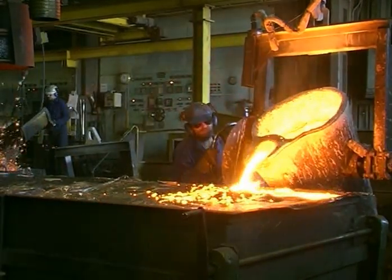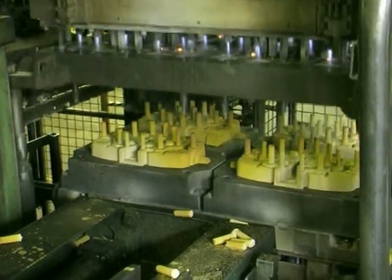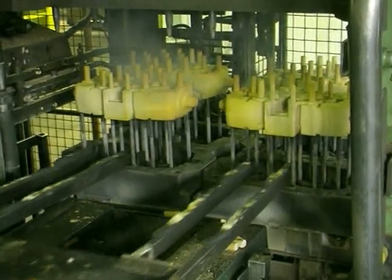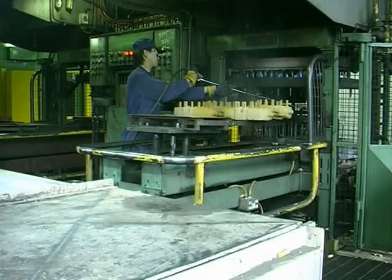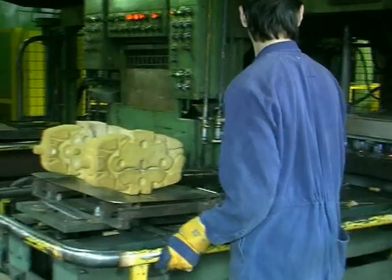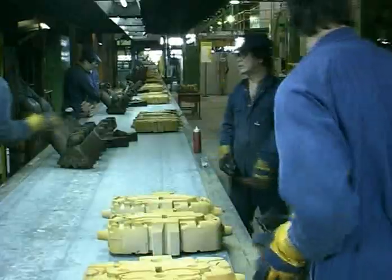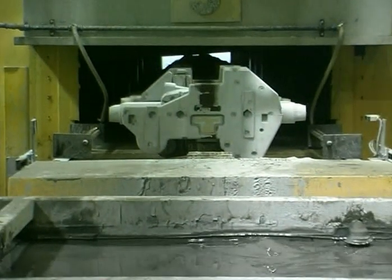The moulds are poured and perfect castings are produced. For very high production rates — over 220 moulds per hour, each containing two engine blocks — the traditional method of making cores was the hot box method. With this process, each operator effectively produced 14 units per hour, each assembled from 12 separate parts. But with a modern cold box method of core making, the output per operator is 40 units per hour, assembled from five separate parts.